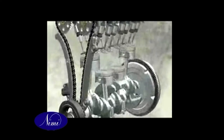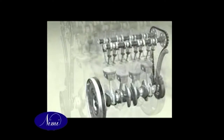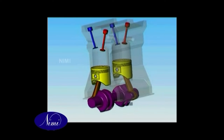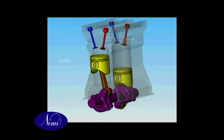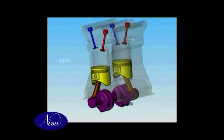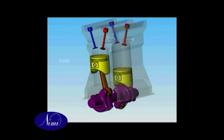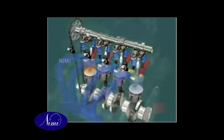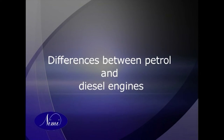The flywheel of a multi-cylinder engine is lighter in weight. In inline engines, the cylinders are placed in a single row. Twin cylinders are used in motorcycles and some small cars, giving one power stroke every 360 degrees of crankshaft movement. Four cylinders are commonly used in cars to give good balance to the crankshaft.